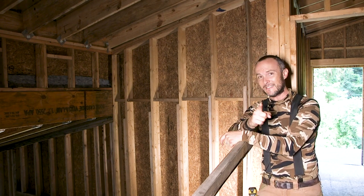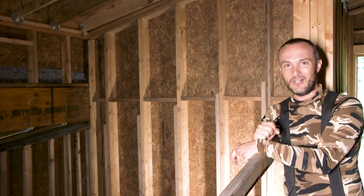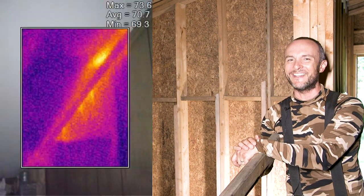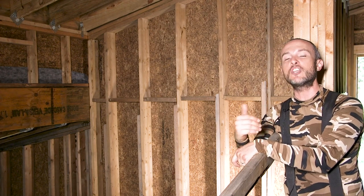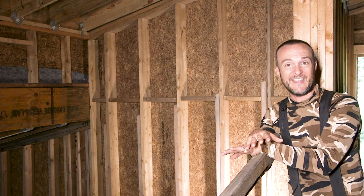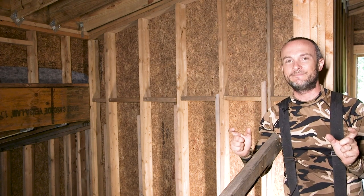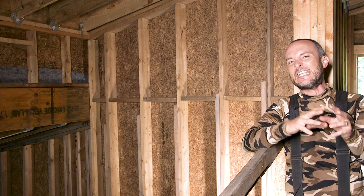The reason we're fixing this is that performance is findable after the fact. With an infrared camera — even a $200 model a homeowner would buy — you'd be able to see that the builder screwed up. And it's not just about optics. It actually makes a difference on the real performance of the home, because insulation slows down heat bleed. If it's not uniform everywhere, it doesn't work well. Heat flows in a nonlinear way — exponentially more heat goes through uninsulated areas than through properly insulated ones.